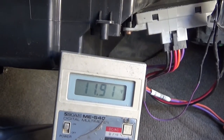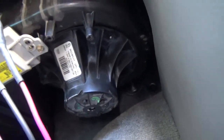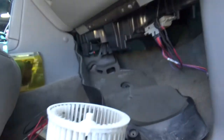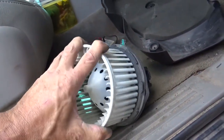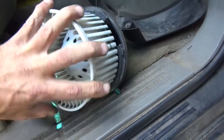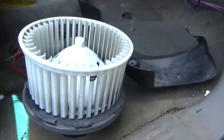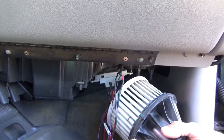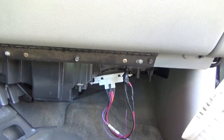So let's go ahead and check that fan motor. This particular style of fan is something that's kind of new to me — you grab a hold of the whole fan, rotate it, and the whole thing goes down and out. I can tell you right now this fan is junk: it's very stiff, very tough to turn, so this motor is seized. We're going to let the customer know he needs a new fan motor. I'm going to plug this back in just for a laugh to see what's going on — and we've got it working. If you hear that chirping, that bearing is going to seize right back up again, so we're going to replace this motor and we'll be done.